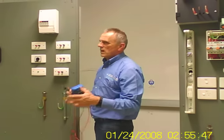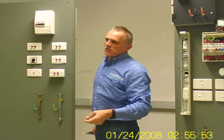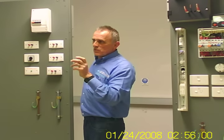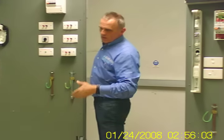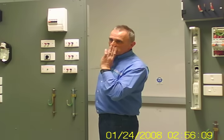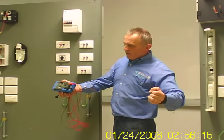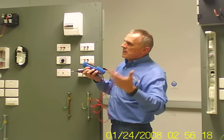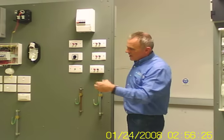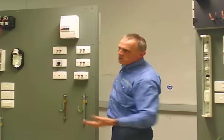Okay, so basically what you've got to understand is what happens when we have a break or high resistance neutral. In fact, you can run a whole installation, as I said before, without a neutral. If your ground has a very low resistance, sometimes installations can work without a neutral. It's only when a plumber breaks that earth current path, that's when he experiences shock and he calls the power company and discovers a broken neutral. So it really depends how the current return goes back to the transformer, how good our earth medium is, how good the resistance is.